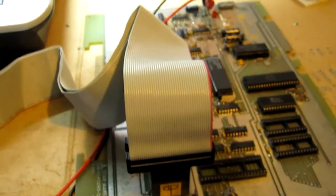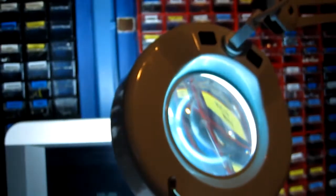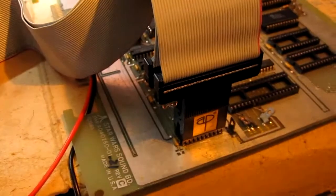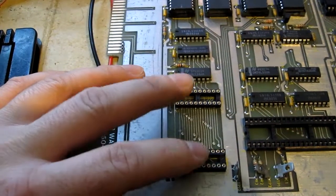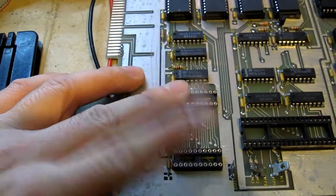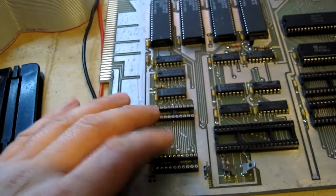I can't operate this sound board standalone, so to test it I'm using my board master. Annoyingly the LCD backlight's gone so I have to shine a light on it. I've brought this up on the 74LS374 and run a test — it looks like there's potentially a bad output on pin 3Q. I decided both 74LS374s looked bad — the one for reading and the one for writing data.